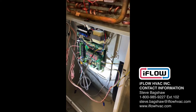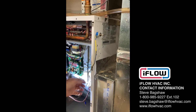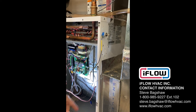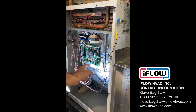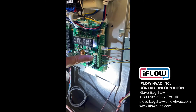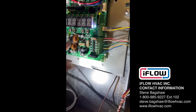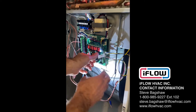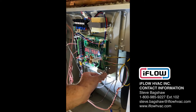Now we're going to look at the temperatures. We've got a potentiometer here — this potentiometer simulates an outdoor sensor. We can run this from 70 or 80 degrees right down to 40, 50, or 20 degrees if we want. We've just got a call for heat from the thermostat. If we look at the board, you can see the red light where the heat call is, so we know there's a call for heat. Let's go into information mode — the outdoor temperature is 75 degrees, so it's quite warm.